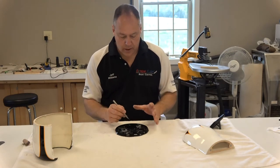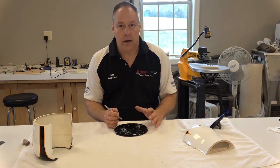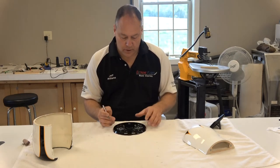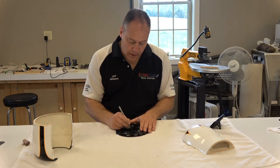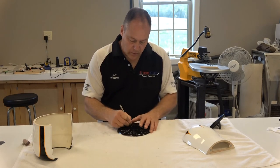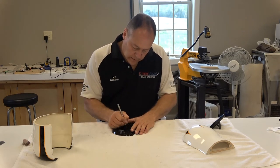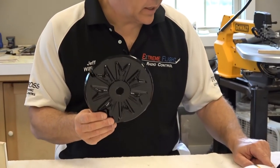The next thing I'm going to do is just get a hole in it. You could do this with a Dremel tool, that would be fine. Just don't get too aggressive a bit because this is thin stuff and we certainly don't want to break the piece. I go inside and just start making a mark until I get down through it — just a straight mark. It goes down pretty easy, and then once I'm in it I just kind of cut around.